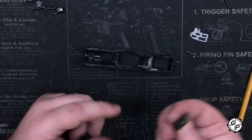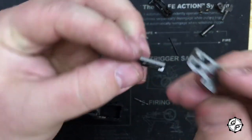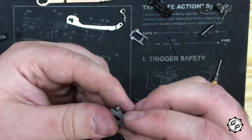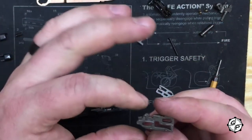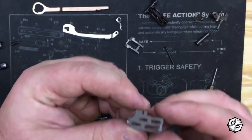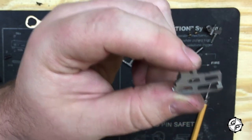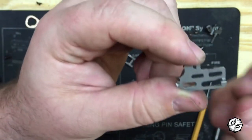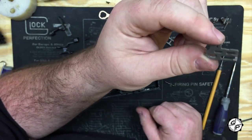So we're going to set the blocker off to the side. Now here we have our two actuators. Both of them have the hooks. This one actually has a protrusion — this is the actuator that the trigger bar hooks to that actually fires everything. It's impossible the way they have the chassis cut, but if somehow you managed to put these in backwards, nothing's going to work. This is your actual sear actuator, and this is your locking cam actuator — this locks everything in place. You can see they've gone to a lot of trouble in the castings of these with lots of little holes and openings. As this slides forward, that locks everything in place and won't allow side-to-side movement, which takes a lot of the slop out of the sear housing and makes for a very nice trigger.